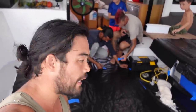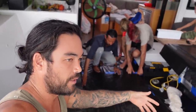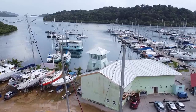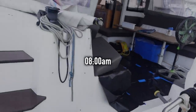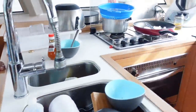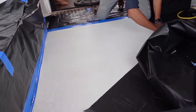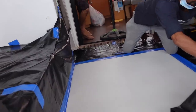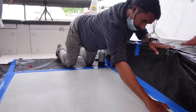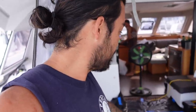Here we go — two coats of PVA, two coats of wax underneath that. Tomorrow morning we'll do one more PVA and then roll the gel coat. We'll show you as we go. Now it's protected for the night. Next morning, we put one more coat — one more layer of PVA — so that's two layers of wax and three layers of PVA total. Then we'll start rolling gel coat.